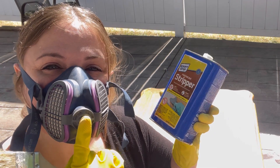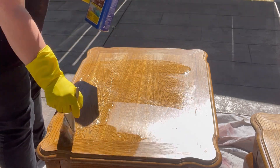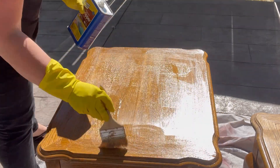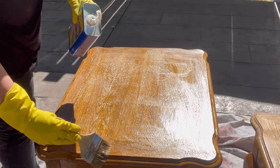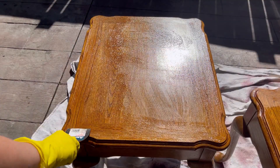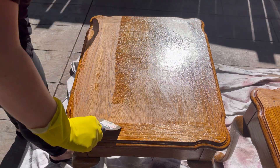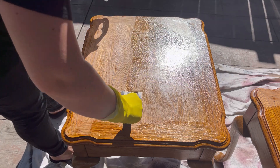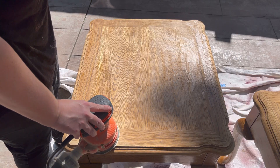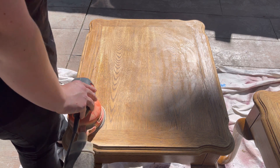I have Clean Strip, my mask, and my gloves. Because I don't have a soft padded sander I have a really hard time sanding these edges, so if I do one coat of stripper first I'm going to have a much easier time removing the finish off of the sides. I'm using Clean Strip today because I have it — usually I don't because the scent is so strong and gives me a migraine. You don't have to cover it; you just leave it for 15 minutes. But the sun was drying it quickly so I only kept it on for about five minutes, then did a quick wash with steel wool and mineral spirits to make sure all the stripper residue was removed.